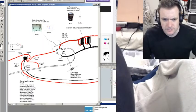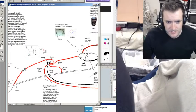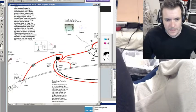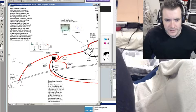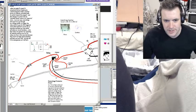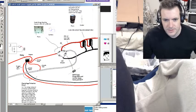Here is my relay switch. The AC 120-volt 15-amp hot or live line comes through and enters the common line of the relay switch. The normally closed line is where it comes out, and then it enters the rectifier and then the caps, so it becomes DC here.